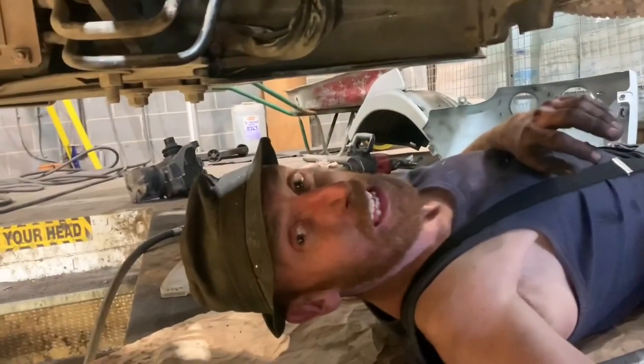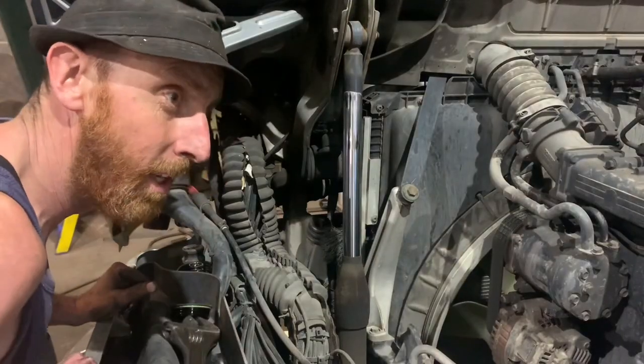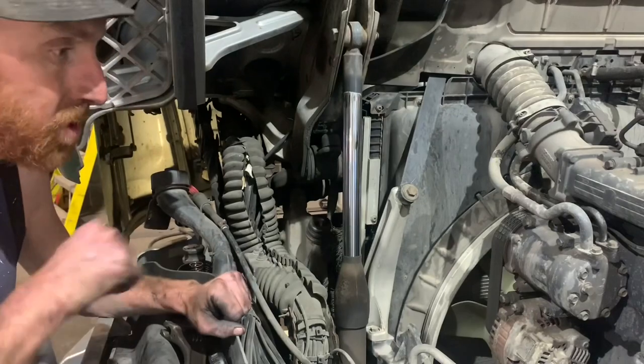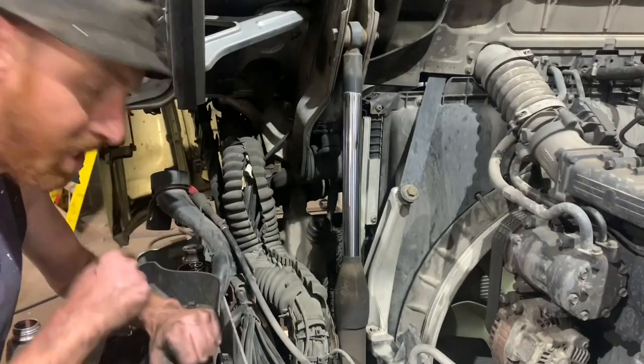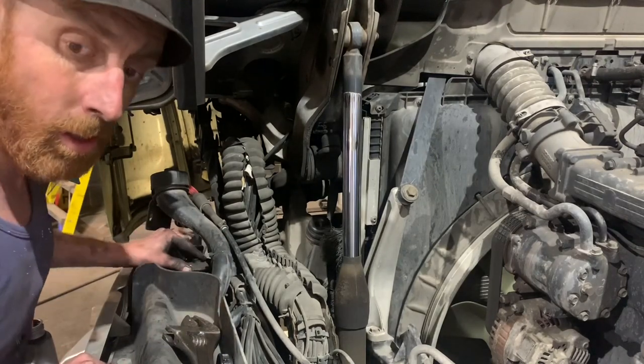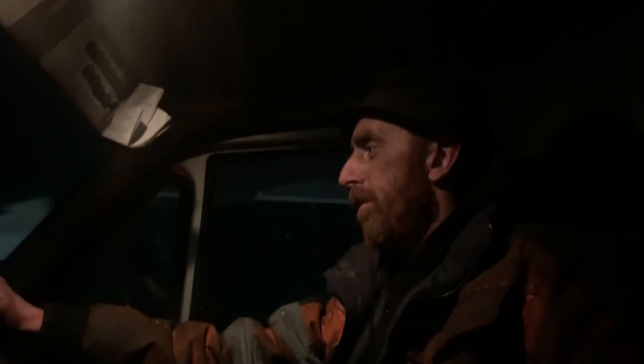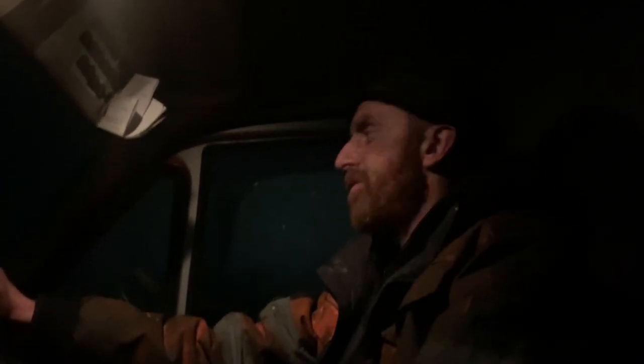You never stop learning, do you? Look at the keyway in here. Topped up the fluid. Keep the front axle jacked up and just walk it from side to side with the front axle and their weight on it, to bleed the system through, and then just keep checking your level. That's it really. Should be a winner, winner chicken dinner. Obviously filled it up, bled it all up - turned the steering side to side, got it bled up.